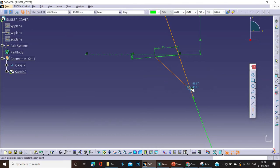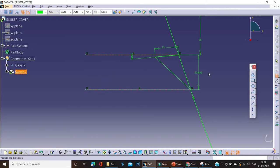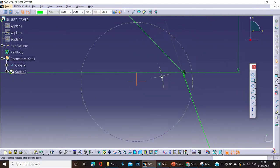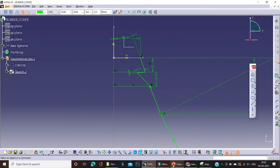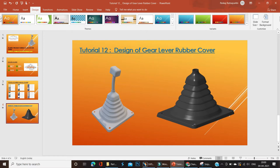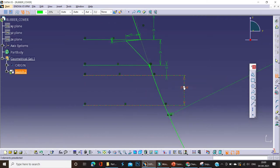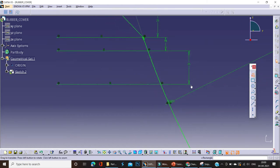The rib-to-rib distance will be kept at 20 or 25 mm. There are 3 or 4 — whatever number of ribs you require — you can add here with the same dimensions or as per requirement. We'll add ribs 1, 2, 3, 4, 5 here. You can use multi-sketch or make a single sketch for all the sections. You can also use the pattern command, but for simplification we'll do all the sections in a single sketch. In between two ribs we'll keep a 10 mm distance.